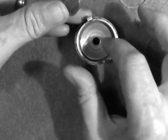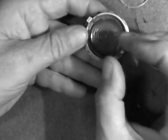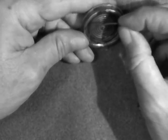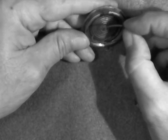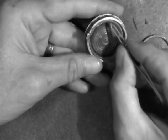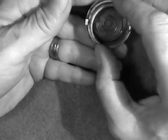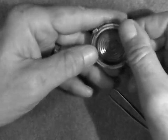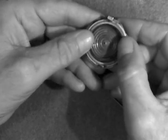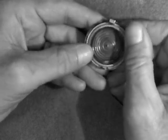When the new gaskets arrive, all you do is pull off the old one, clean your diaphragm, put the new gasket in the bottom, drop the diaphragm back into position, put the new gasket on top of it, line up your little spring ring — it has a little key slot, a little peg sticking out that fits into the hole directly under the limit loop — and pop it back into position. Gently push it down with your tweezers or a small screwdriver. Now you take your retaining ring, put it in position and slowly tighten down. It's sometimes difficult to get these threads to line up as they're very finely threaded, so be very cautious that you don't cross-thread it.